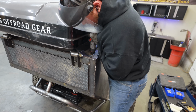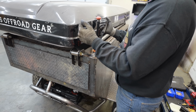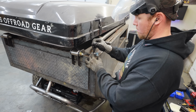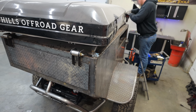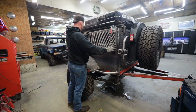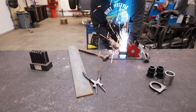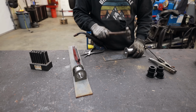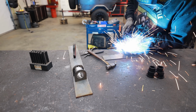I made a little tweak last year in the way that I install riv nuts, and that is that I glue them in with Gorilla Glue now. I used construction adhesive for a long time, and I didn't have any problems with that, but Gorilla Glue has such a good bite in my experience, and it even seems to seal pretty well. So for right now, I'm experimenting using Gorilla Glue to help keep things from spinning once it cures, but if that ever turns into an issue, I will let you know.